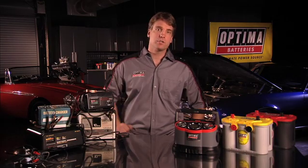An Optima has the benefit of very low internal resistance, which allows high amperage output as well as efficient recharge acceptance. This benefit also allows an Optima to run longer than its specified ratings and run to a voltage lower than typical flooded batteries, which can sometimes lead to confusion when it comes to recharging a deeply discharged Optima.